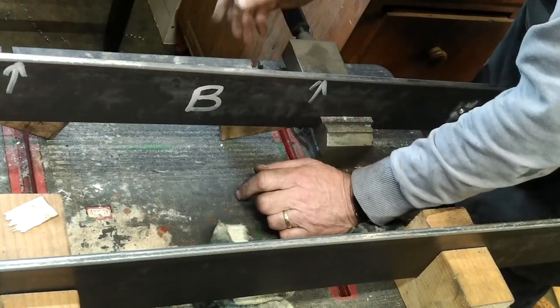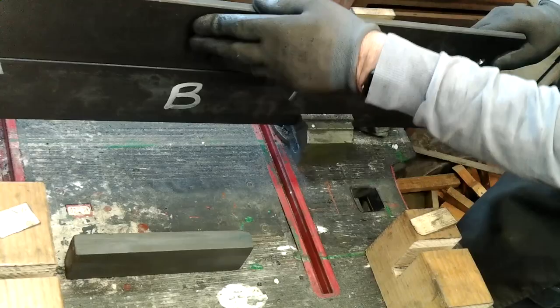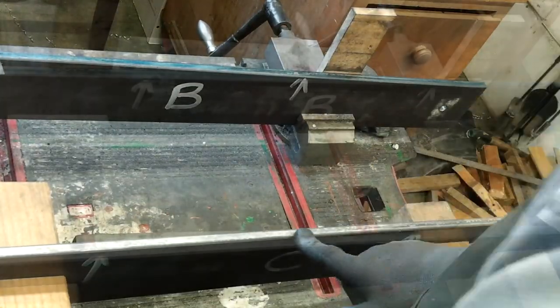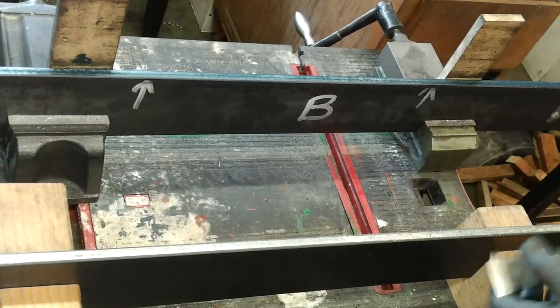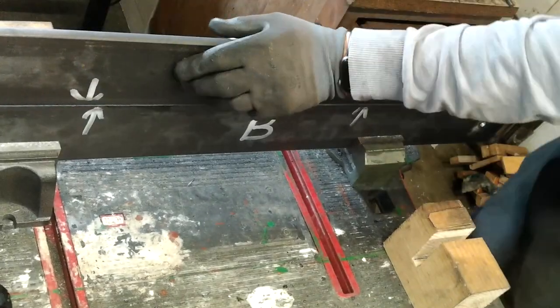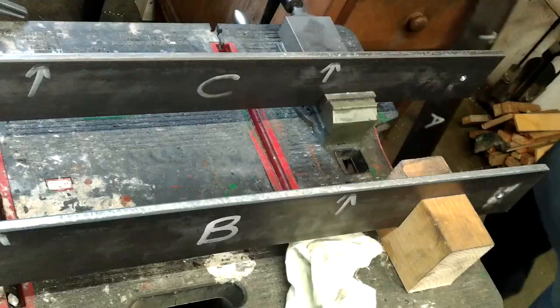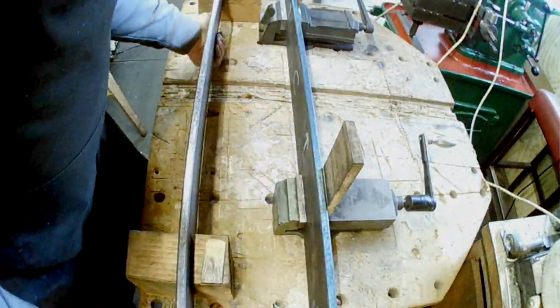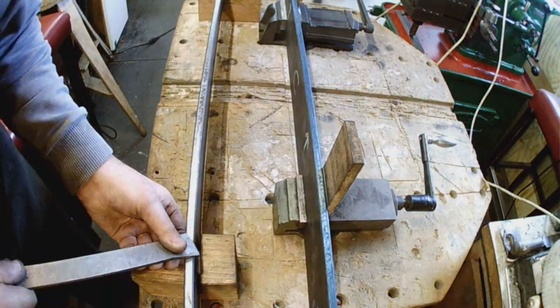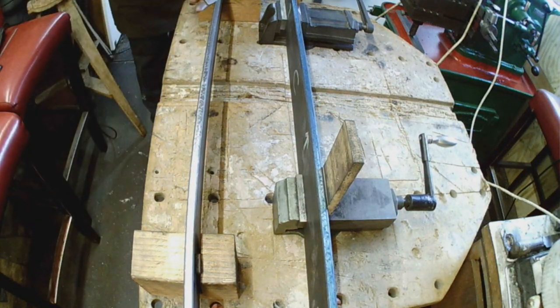My answer on accuracy is that these aren't being produced under controlled conditions or with the correct material to be anything other than quite good with an acceptable level of tolerance. If the straight edges will only be quite good, how do I expect to use them to accurately gauge the bedways? I inquired about the cost of having the main bedways reground and the best quote I got was equal to the cost of a small new car. So I'm left with two choices: scrap it, or have a go at improving the bedways myself — that's if the bedways do need fixing. Will I do as good a job as the professionals? No. But do I think I can make it better than it already is? Yes, I do believe I can, even with the limited tools to hand.